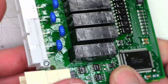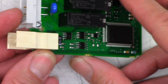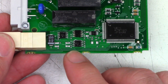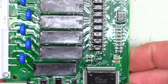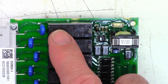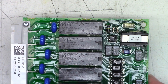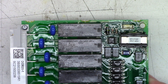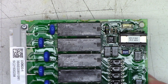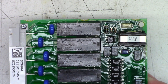That's the output side, and there is the connector — that is the data communication to this module. It looks like it basically connects into this module right there. The problem I was having was with output number one, this relay contact right there. It does show 12-volt relay contacts right there. The date on the relays looks like possibly 1950 — I'm not sure what that is.